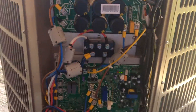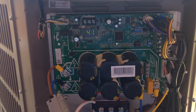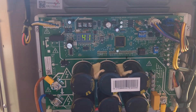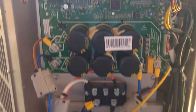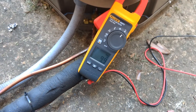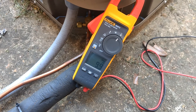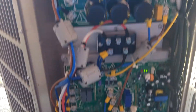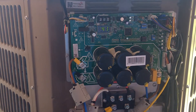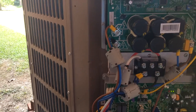This is what our board looks like. That 41 that you're looking at is actually the frequency, and if you take another look, you'll notice there's a 9.9 there — that's the actual amp draw. So at the moment this system is not running at 100% because there's no need for it in the home.